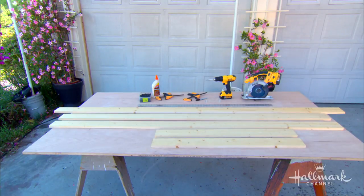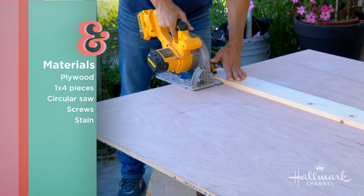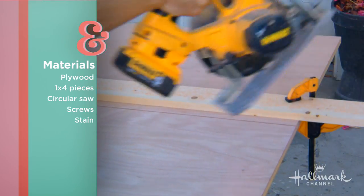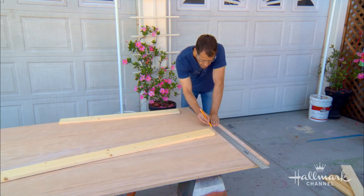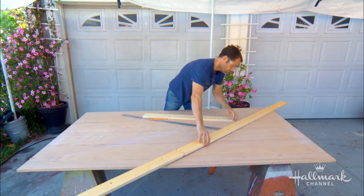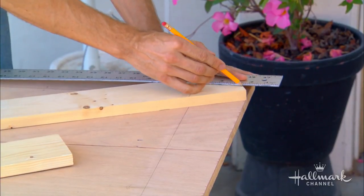These are the basic materials. You've got a piece of plywood — your basic three-quarter inch ply. You're going to find the center on your door; that's where you put your first cut. You offset from that cut about an inch to allow for the saw — about one-eighth of an inch deep — and you do that probably three times to make a paneled look. On mine they're about eight and a half inches apart, but it's determined by how wide your door is. Then you draw the guidelines for the one-by-fours as a border around the outside, and do the same for the cross beam through the middle. It might seem daunting, but it's pretty straightforward — just lines, 90 degrees, and cuts.